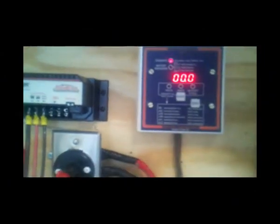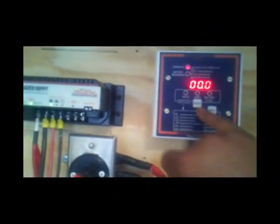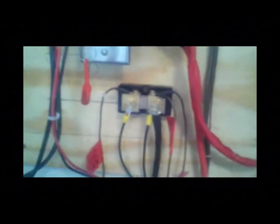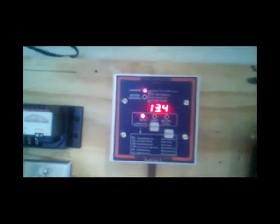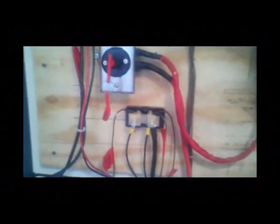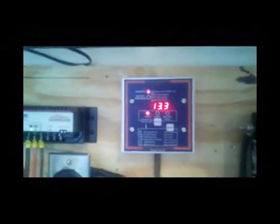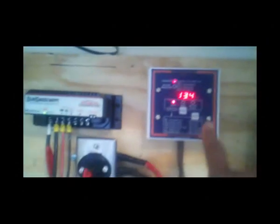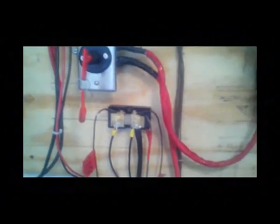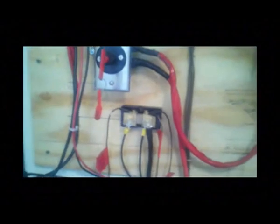The lowest voltage recorded in the system was zero volts. At the bottom left you see the shunt, which is part of the Tri-Metric battery monitor system. The shunt allows the Tri-Metric to receive amp information — current passes through the shunt, and signal wires transmit that information up to the battery monitor. When buying one, you have to specify the correct type of shunt; be sure to specify it correctly — that information should be on the website where you purchase your battery monitor.